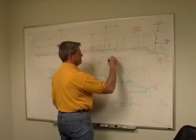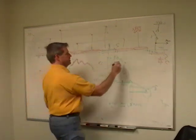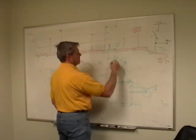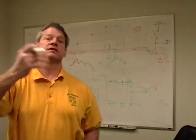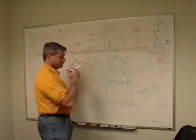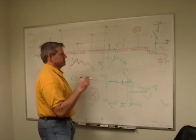And from my tech days, I remember that it takes about 5 tau to get to 99.9% charge, or maybe it's 99% charge. So to get that thing charged up all the way is 5 tau, 5 RC time constants, 5 times RC. And the more R is, the flatter that curve becomes and the longer it takes. If you want to read out fast images, 30 frames a second, 60 frames a second these days, if you want to get into really, really high speed stuff, 5,000 frames per second, depending on what you're doing, you can't have that. So they go to indium tin oxide, which brings along its own set of problems. But it's a minor tweak from tin oxide.